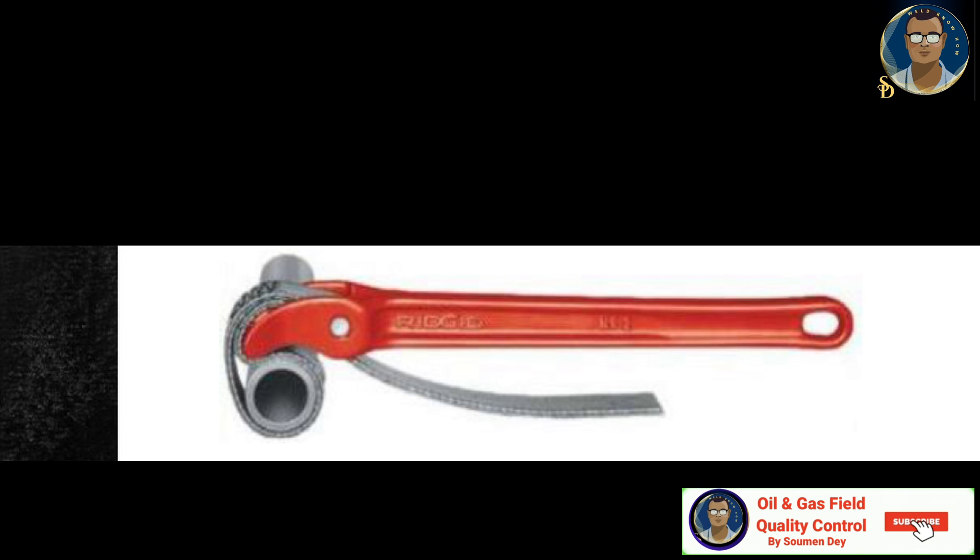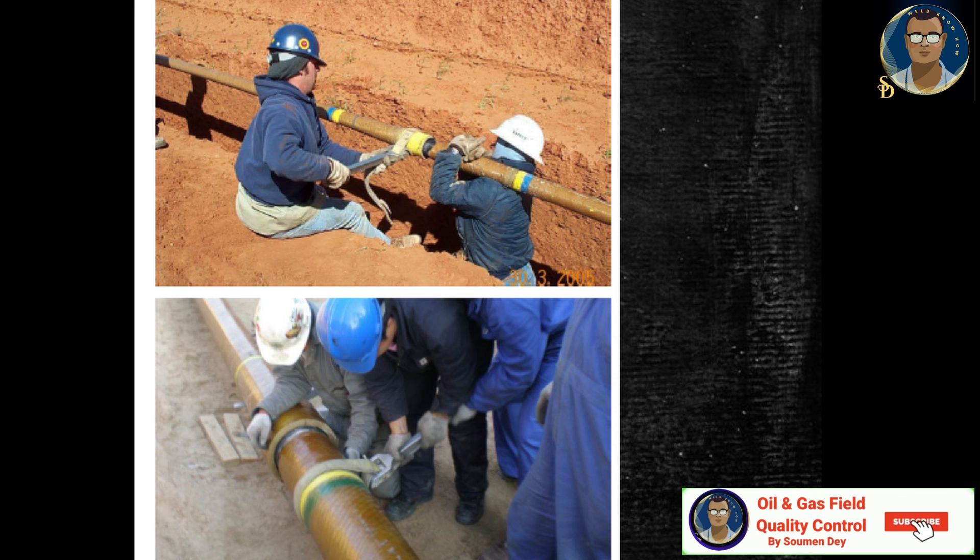The wrenches — as in the photo, you can see their application also. All yellow box joints are designed with an extra thickness at the end called pipe upset. While making up a pipe joint, all wrenches shall be applied only on the upset area.